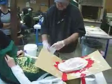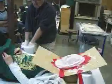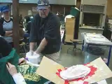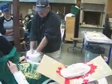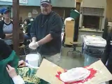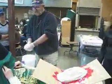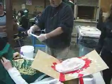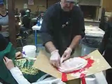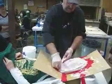The alginate won't stick to the plaster bandages. The alginate doesn't stick to anything, including itself. That's why you have to do everything all at once. If you want to stick alginate to alginate, they have a special chemical that you mix up and spray on. So it dissolves the surface of the alginate so you can bond alginate to alginate.